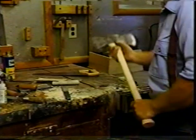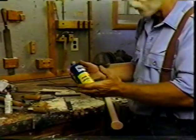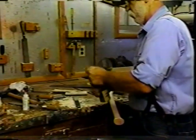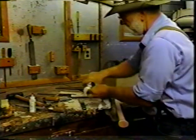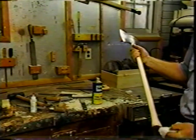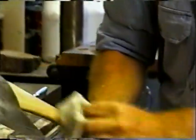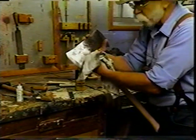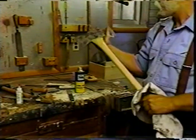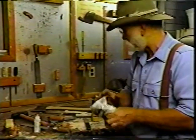The last thing in this step is to oil it with linseed oil. This is pure raw linseed oil — you can use boiled linseed oil too, it works just as well. Take a rag, put a little bit on it, rub it on the butt, rub the oil into the handle real good. After you finish, wipe the excess off and be sure to throw your oily rag away. Spontaneous combustion with oily rags is absolutely a hazard — I've seen them burst into flames before, so throw it away when you're done.